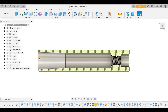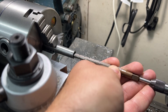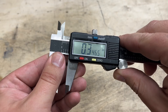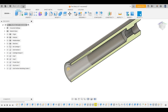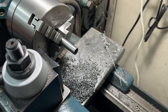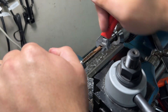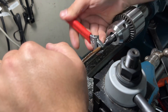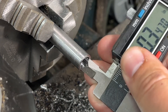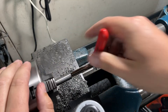I'll now be making the taper on the inside of the cap. Once again I'm using a tap follower and I'll start out with the roughing reamer to clear out most of the material. To make sure I don't overshoot the size of the taper I set my caliper to the diameter at the opening of the hole in my CAD model. After checking progress I can see I still have a bit of material to remove before switching to the finishing reamer. Going back with the roughing reamer I keep removing little bits of material before checking again. When I check the diameter I can see the size is almost perfect, so switching over to the finishing reamer I finish out the hole. That's all it took to get the hole to the final size.